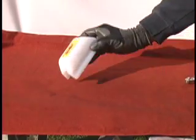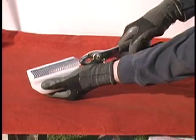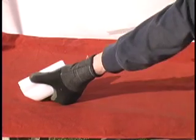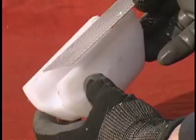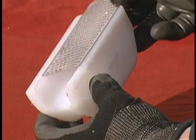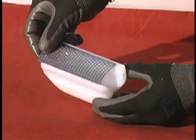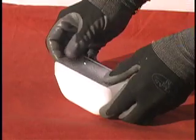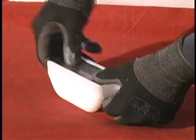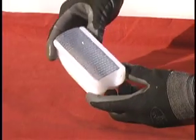To remove the blade for replacement, hold the handle in one hand, grasp the end of the front edge of the blade with the pliers, and pull straight back. To seat a new blade, slide one edge into the blade groove on the right side of the handle, with the pointed ends of the blade toward the closed ends of the grooves. Next, firmly press with your fingers or thumbs on the opposite side of the blade till it snaps into the other groove. Be sure you seat the blade with the cutting teeth oriented upward.